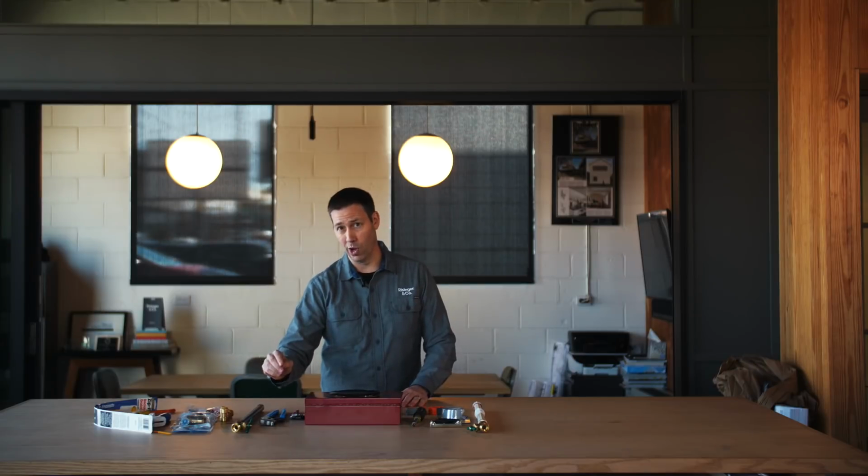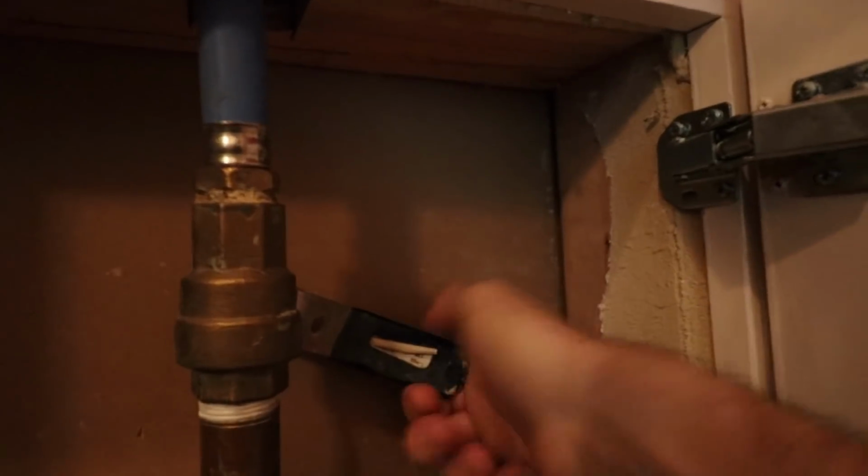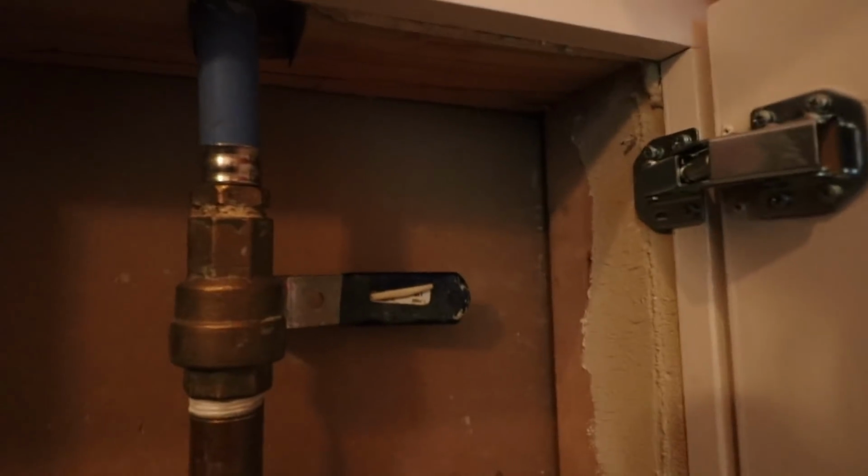All right, in the build show today, I've got 4 tips for you on how to deal with plumbing emergencies. Now, number one, the first thing you want to do anytime you've got any plumbing emergency is shut the water off. If you've got a house built by me or my company, you've got an inside water shutoff. That's going to be a ball valve that all you got to do is turn a quarter turn, and that house water is going to be totally shut off so that now you can fix the leak without water bursting out of there.